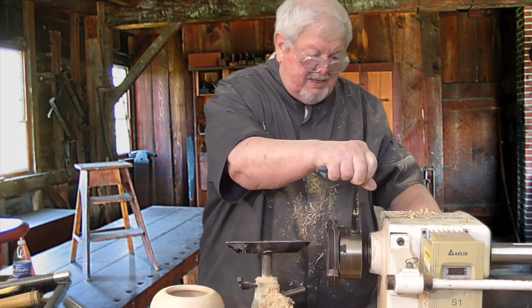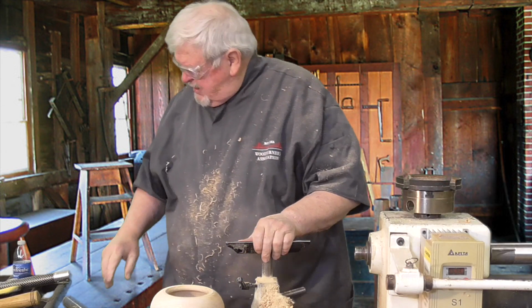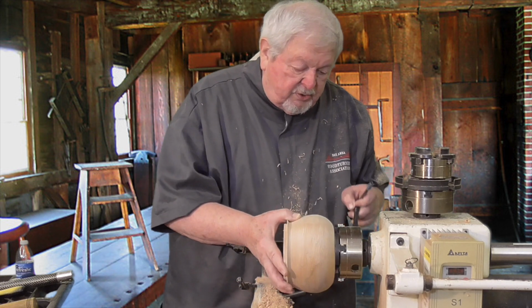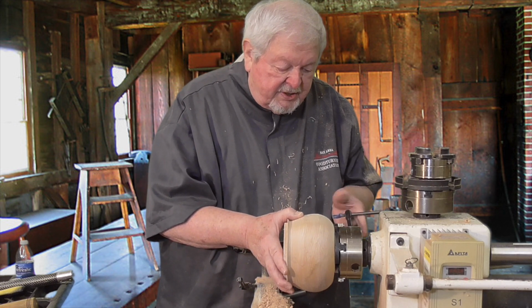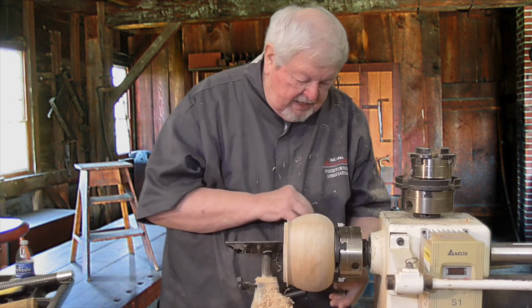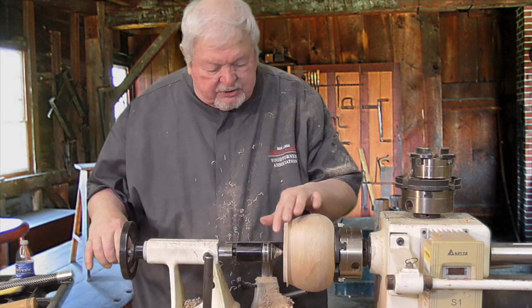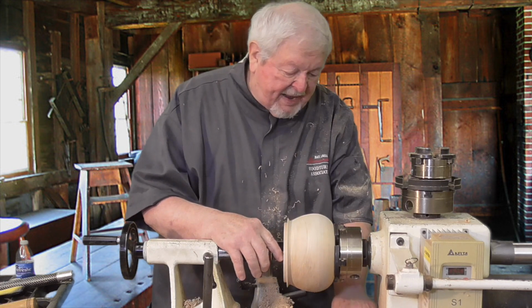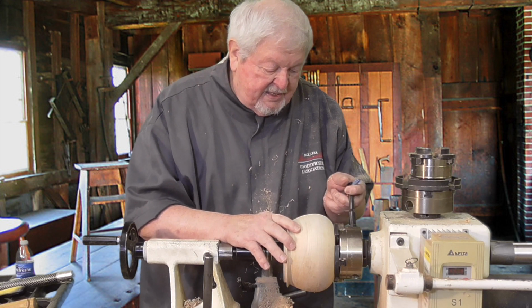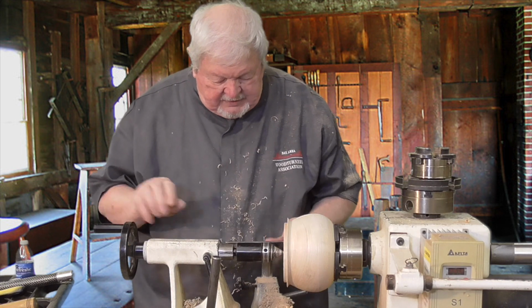See where we are. And let's try this. I went and got another one of these chucks, but with a different set of jaws, a little smaller. So my intention is to put the bowl here, expand the jaws loosely for a minute, and then I'm going to bring the tailstock up for additional support right into that little spot. And I put the cone on here because what that'll do is give me maximum access. So I'm tightening it just the slightest bit. So there's my drive. Here's my hold. And now I can go back and finish.